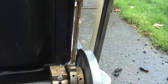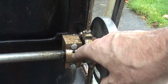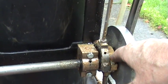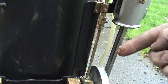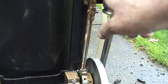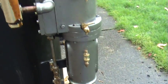There are oilers here which you don't use steam oil on — you just use regular motor oil on all these bearings. The eccentrics here — these two eccentrics will need oil occasionally. There's oil coming out of the engine here which is normal; it lubricates a lot of stuff down there. A little oiler here helps a little bit once in a while.